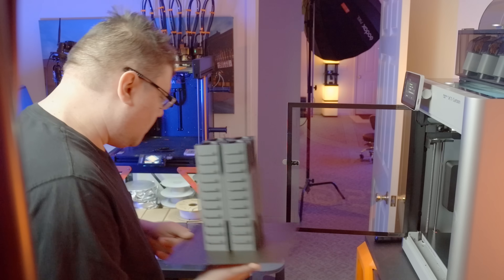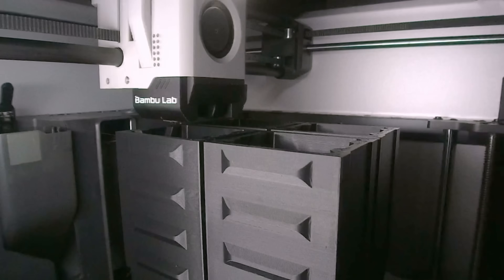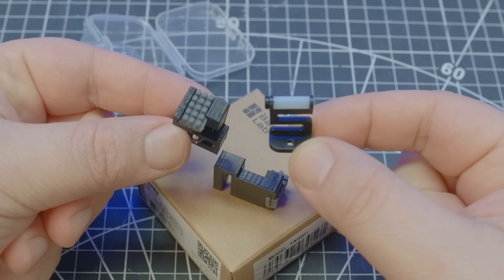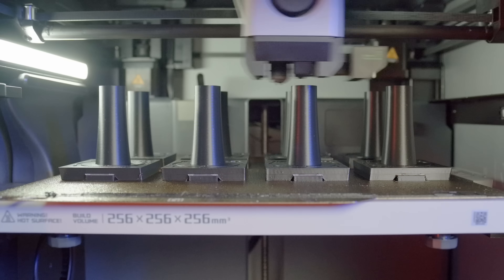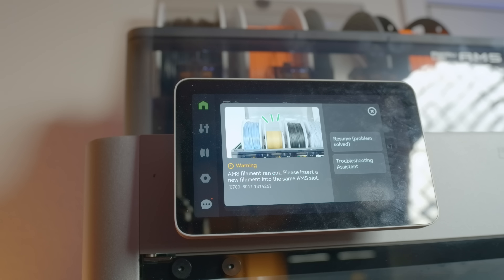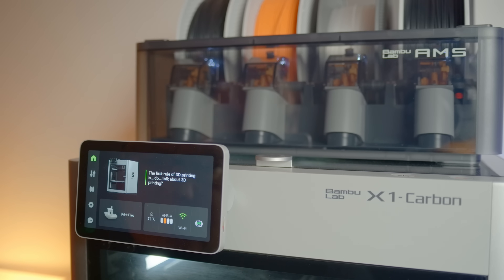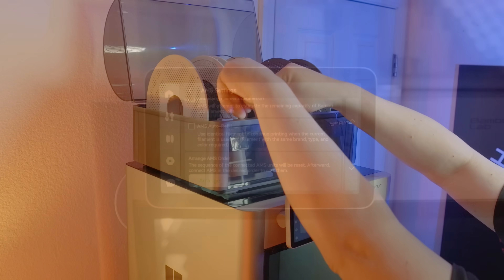Okay, let's make it happen! For this I'm using the Bambu Lab X1C along with the Prusa XL. The main bodies are printed with PETG-HF with 100% solid walls and 40% gyroid infill for the thicker transitions along the ends. Bambu Lab even sent me a few revised nozzle wipers to actually wipe the nozzle, which matters here as I swap to an interface material for clean undersides along the backs of the vent pieces. The only new party trick I can't say I care for is what happens when you run out of filament and go to load more — it's just a stuck screen until you reboot. The only workaround is to preload the AMS with as much filament as you'll need for the entire print job and simply ensure that autofill is enabled.